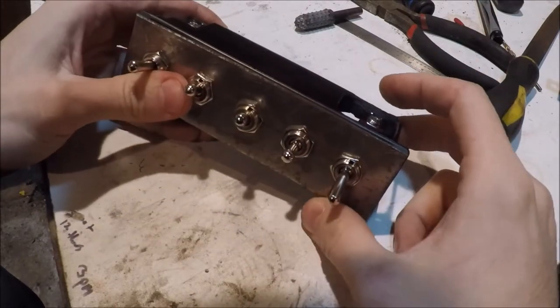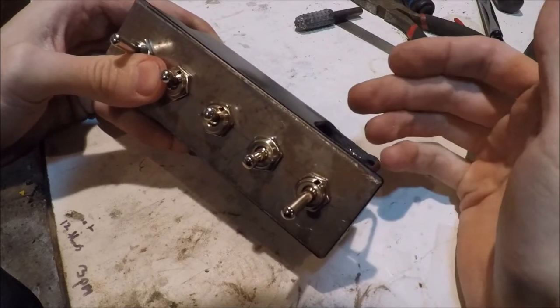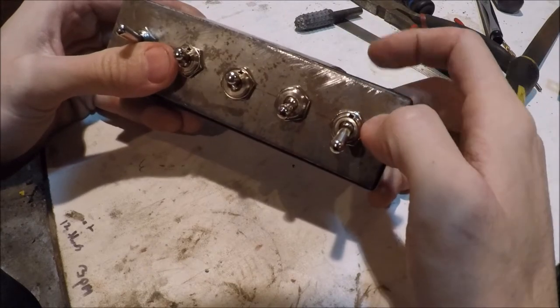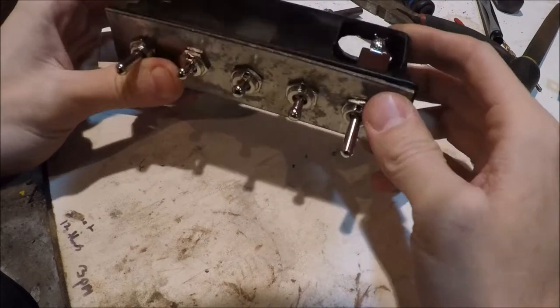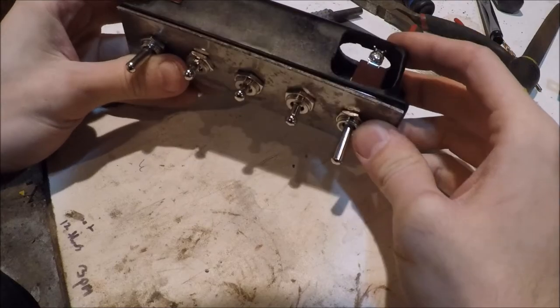What we have to do is actually drill a hole into the plastic where the ashtray unit is, or else the wires aren't going to be able to fit behind the dash. So that's going to be our next step — I'm going to quickly run outside and grab the plastic unit.